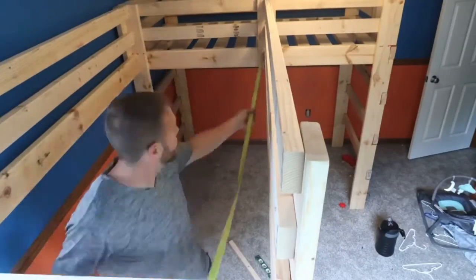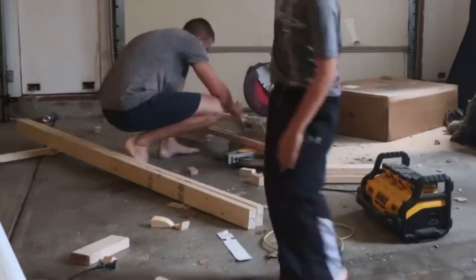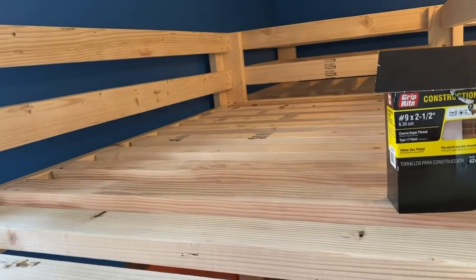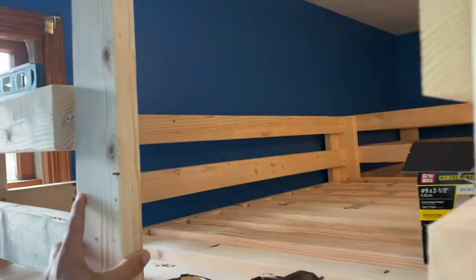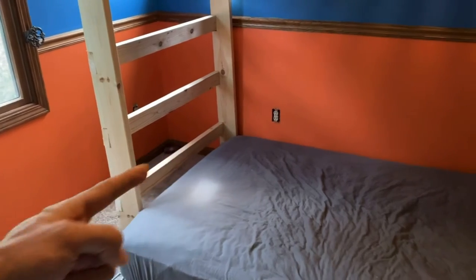We're doing the slats at 37 and 7/8 inches — that's almost all we have left besides enclosing the end. It takes 12 two-by-fours at 37 and 7/8 to make the slats. Then you take two leftover pieces at a little less than 21 inches to make the entrance to the bed. The twin L loft beds are built.